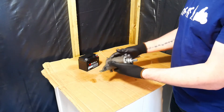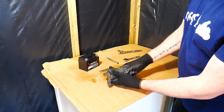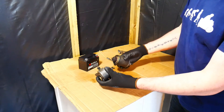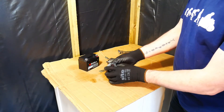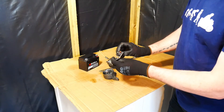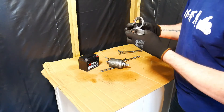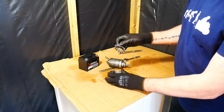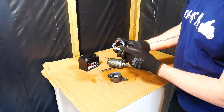Let's take out these two long bolts that hold it together and we should be able to disconnect this end. Let's look at this end first of all. We have a little plate that comes out — this is called the brush plate. Looking at it, it's actually damaged somewhat. The brush plate has two little carbon brushes on it.